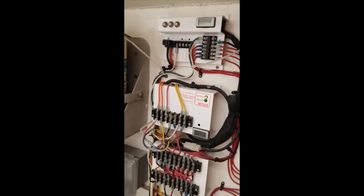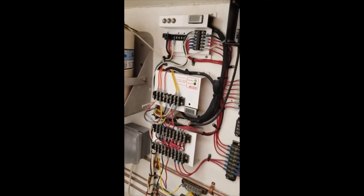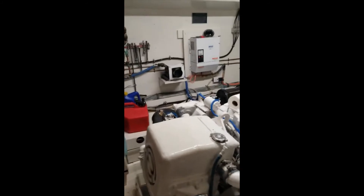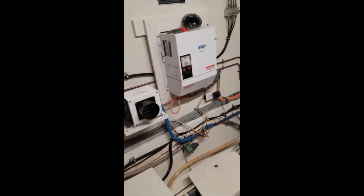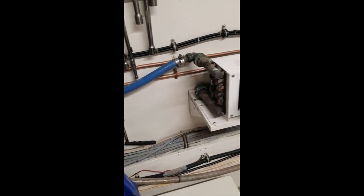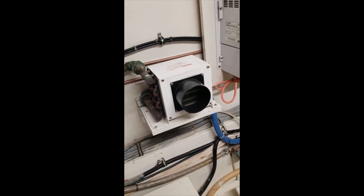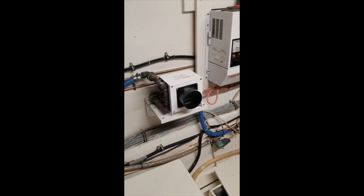It runs off 12-volt DC, so you can run it even when you're underway — you don't have to be plugged into shore power, which is nice if you're traveling. In each room of the boat — the staterooms, the galley, everything else — there's a separate hydronic unit. This one happens to be in my starboard engine room, which is nice because it keeps the engine rooms nice and warm; I don't have to use block heaters or anything. Each room has a little unit like this where the coolant comes in, blows through a fan unit, and circulates back out. Each room also has a thermostat to cut it on and off and set the temperature. Too bad you can't feel this nice hot air coming out of here keeping this engine room nice and toasty.